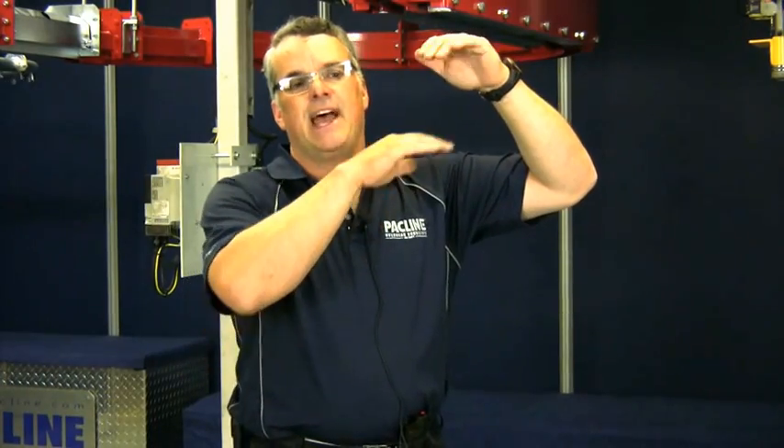Let's move on to probably the number one problem we find with our overhead conveyors. We get a service call, we go to site, and 90% of the cases we find that it has to do with improper tensioning of the take-up unit. A properly designed system will have a drive unit at a high elevation and a take-up unit located as close to that drive, and quite often after the first decline from the drive. So you have your drive up high and your take-up down low — we want the chain to be naturally pulled out of the drive. I have a drive on the table here, and we'll discuss exactly what can happen to make that drive malfunction. But the biggest thing is that the take-up unit isn't working properly, therefore chain is bunching up in the track.